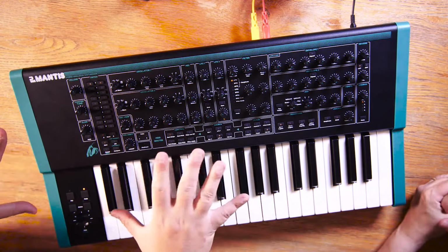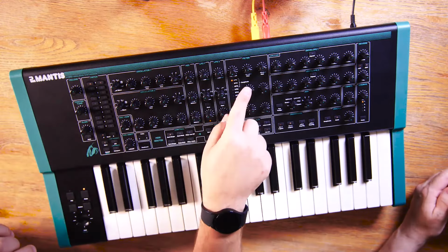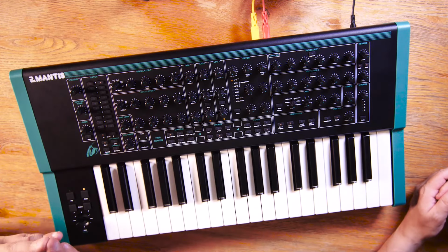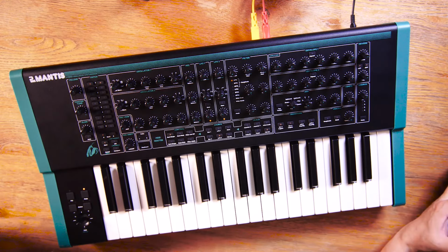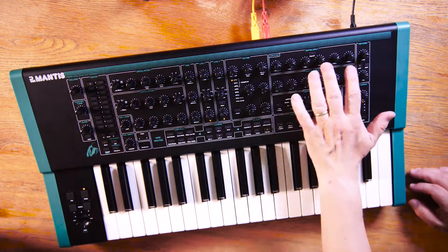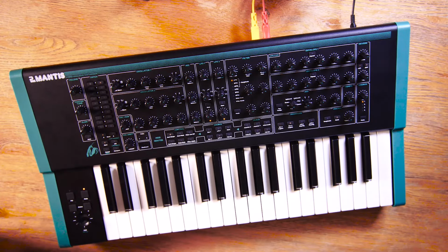Because visually it shares some DNA with Malevolent, and then sonically, am I right in thinking that it's a similar drive? Well, it's actually quite different because the Malevolent, as you know, is an analog synth. This is a hybrid, so the oscillators are generated either via tables or calculated at runtime, so they're actually digital, but then everything across the panel here is digitally controlled analog, so the signal then travels through some analog gain staging, but that is Chris's design as opposed to our partners on the Malevolent, which was Future Sound Systems.